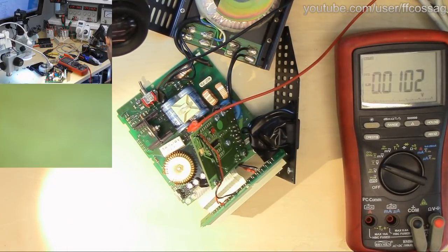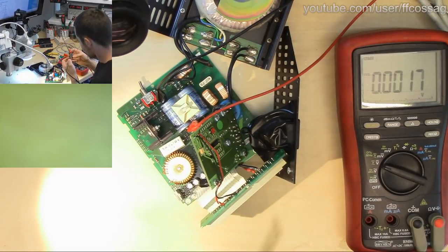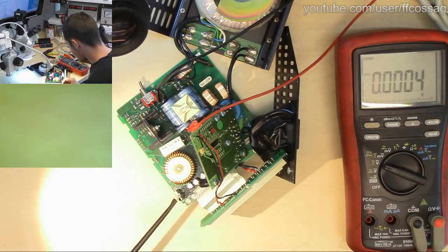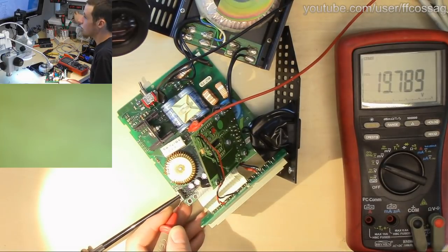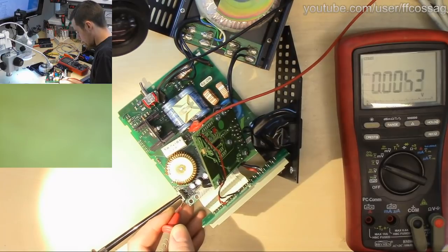What did I just drop? I just dropped something. A piece of copper wire. So let's see what happens. We can just clamp onto the regulator and measure it while we adjust the voltage. So we have ground on the tab, output there. So let's adjust the supply voltage, and it is actually keeping stable. So I think this might actually be working.